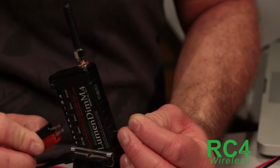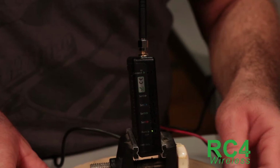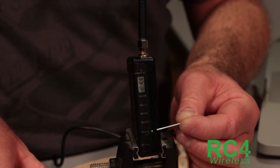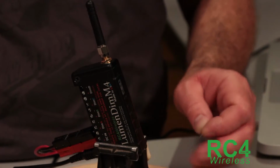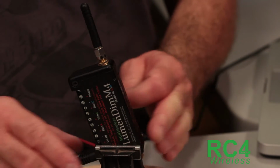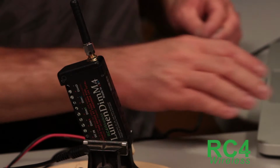When we do that, for just a few seconds, the COP LED comes on solid. You get 5 seconds, and then the device goes back to a normal startup. So that 5-second period is when we want to invoke the process from the computer. So let's go over this. Code loader is plugged into the device. At the other end, it's plugged into my computer, and we'll go over there.